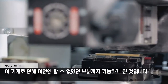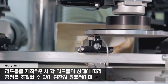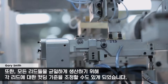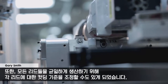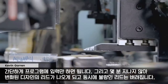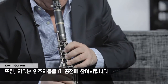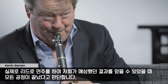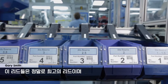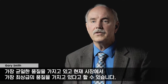It gives us the ability to do things we just couldn't do before — to make reeds and adjust the process from reed to reed in a way that is very, very efficient. We also have the ability to adjust the cut profile to match the reeds. If I want to adjust the tip by a tenth of a thousandth of an inch, I can do that digitally in the program and within minutes have a reed that matches that design, and kick out reeds that might be defects right away. We have musicians involved that are assisting with that process and actually playing the reeds to make sure that the cane is working the way we expect it to. The best reed, the most consistent reed, the highest quality reed on the market today. This machine is revolutionary. It truly is.